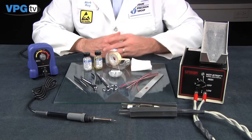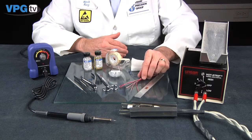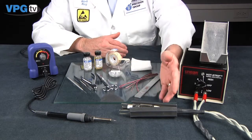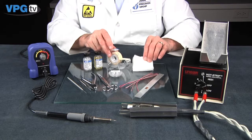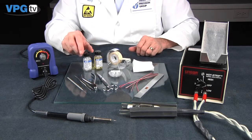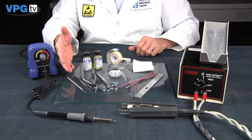The materials I will use are the following: a strain gauge bonded to an aluminum beam, a length of 26 gauge 3-conductor vinyl insulated wire, 361A 20R rosin core solder, a thermal stripper, a temperature controlled soldering station, gauze sponge and PDT1 drafting tape, M-Coat A protective coating, rosin solvent, scissors, wire cutters, tweezers, and a dental probe.